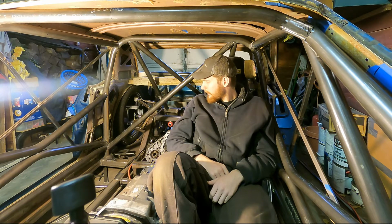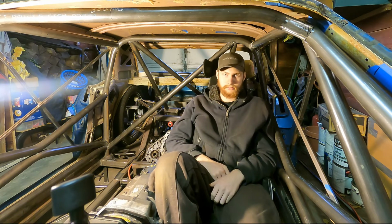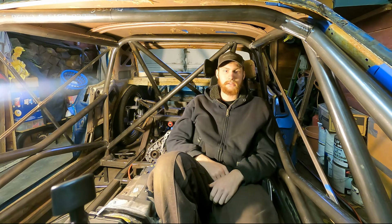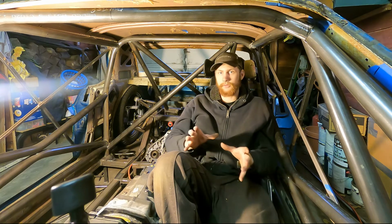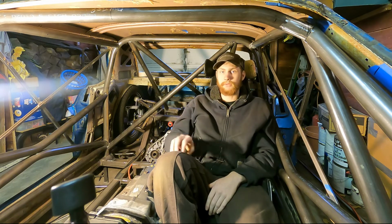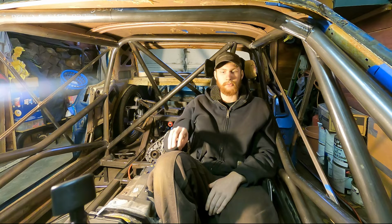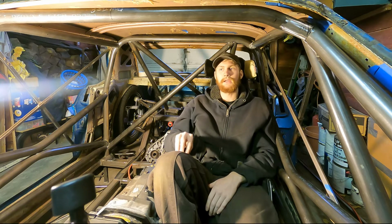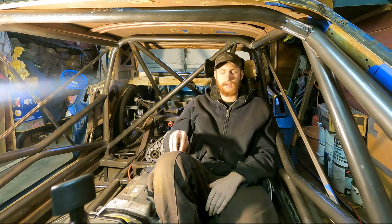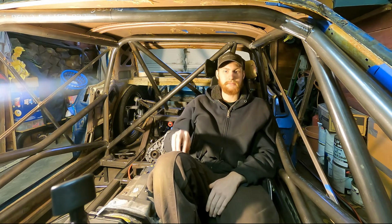So with that in mind, I drew inspiration from the NASA Rally Sport rulebook, which is where I was able to follow their rules to get all these extra bits that I used, because that's what a lot of people were recommending when building a cage for Pikes Peak: build it to rally spec, because the crashes you have at Pikes Peak are more related to a rally crash than a stock car crash, which is actually the stock car roll cages is what Pikes Peak references in the rule books.